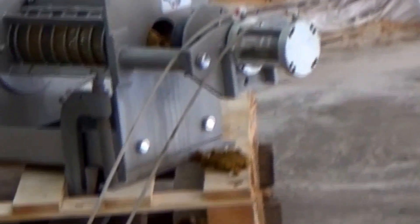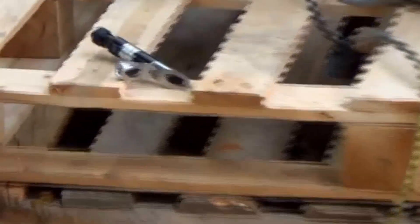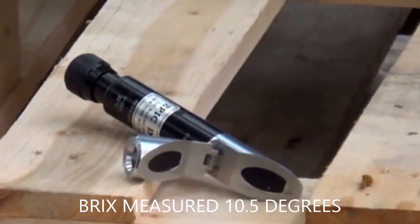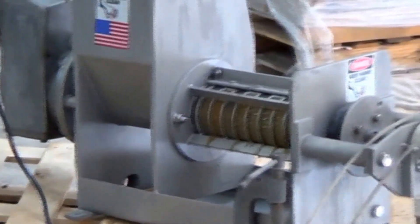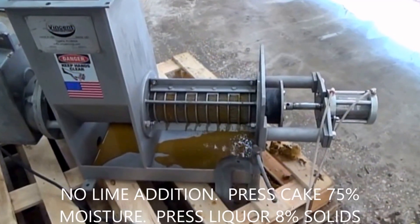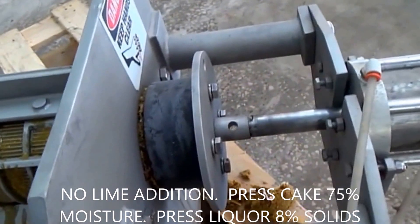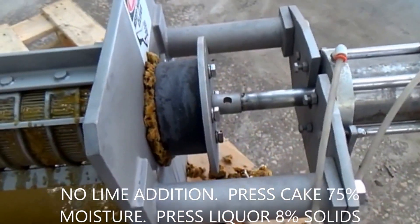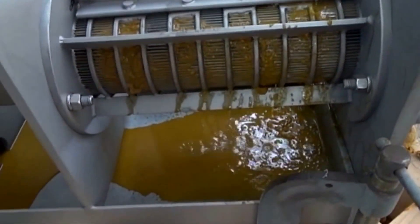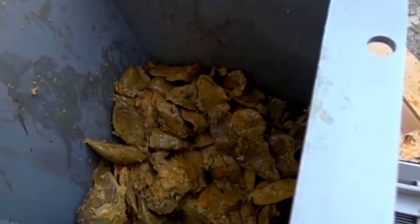I'm going to run in that cone — I can do it from here. Now we'll start creating some back pressure. We measure with the refractometer — the brix — and it's going a little over 10 degrees on the tube that we hope to get out of the peel. I've got the pressure set at 2 bar, and I can see the cone is opening. We're getting a good flow of press liquor, and inside the press it looks like it's bridged.